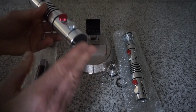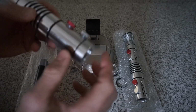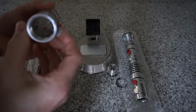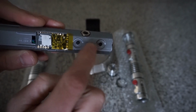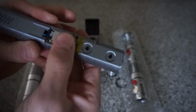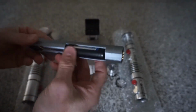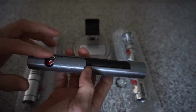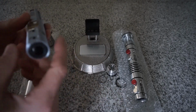Now on the pommel side, these are not buttons. These have just been some custom 3D designed holders and plungers that, when pushed, plunge far enough to hit the switch plungers that are in the chassis. You have your recharge port, you have your Proffie inverted, SD card is up. There's a little cap and tape just to make sure you're not shorting things out when messing around. You have your custom Saber Shop holder and PCB. Battery, 18650 battery, not removable. It looks like it could be removable, but it's not. And then some wire management back here to the speaker, a 22 Veco bass speaker, 4 ohms, 3 watt is what it's advertised as.